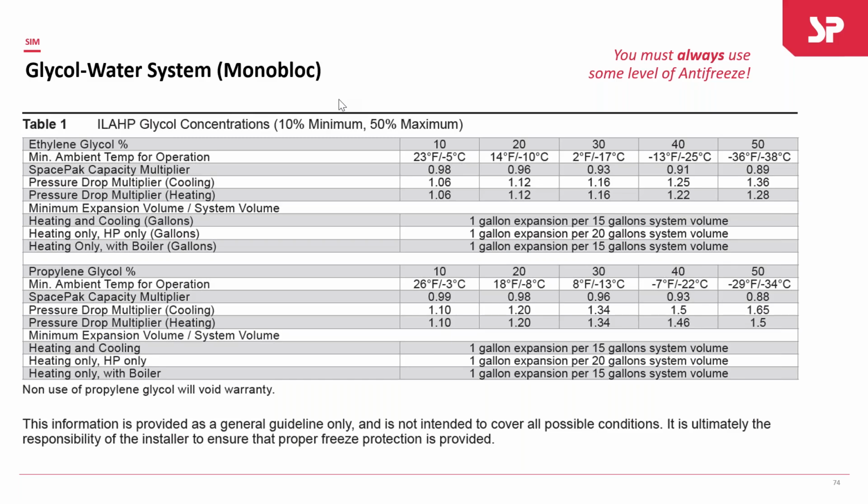If you have 10 gallons of pure water in an exchanger, going next to negative 32 degree refrigerant and the power goes out, how does an exchanger work? An exchanger takes a larger volume of water or a mixture of water and glycol, thins it out, right? Thinner water transfers temperature and energy quicker. The quicker we do that, the more efficient the unit is. So we have a very vulnerable system here, right?